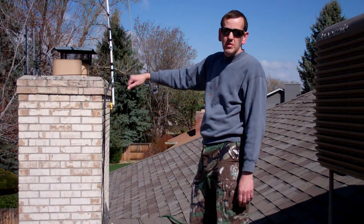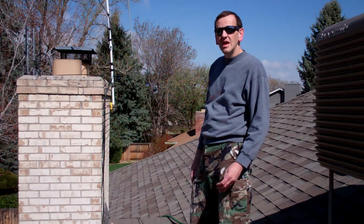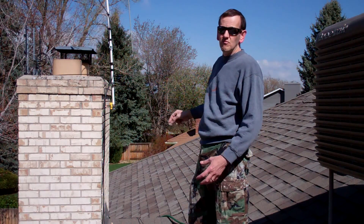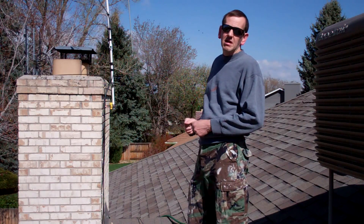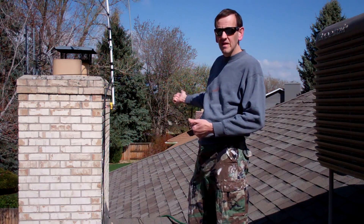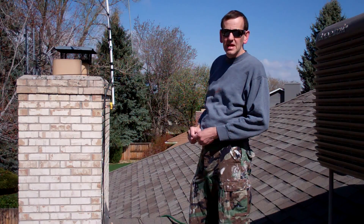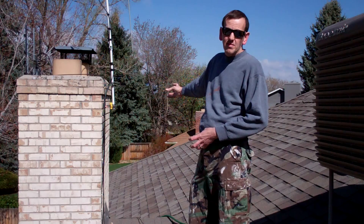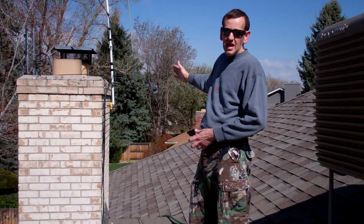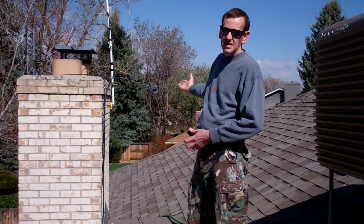I'll just pull it up with a quarter-inch steel cable and some pulleys. That'll take about a minute and it'll be useful. What's on there right now is just the 162 MHz antenna as well as the ADS-B antenna. I'll be able to put more antennas on it because it'll be a sturdier mast than the thin PVC I'm using now. The bracket will be attached by lag bolts to the brick in the chimney and will allow me to pivot the mast up and down as needed.